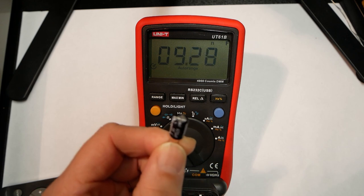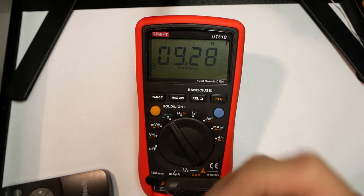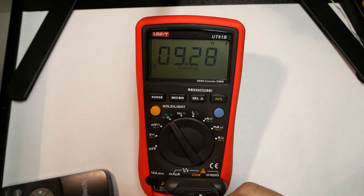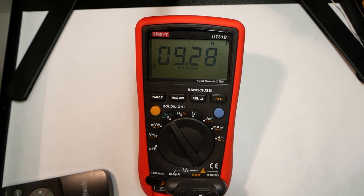And by the way, when you're measuring electrolytic capacitors, if they're big capacitors, like 1,000 microfarads, or they've been in an active system, then before you touch the poles or something, measure it with the voltage measurement to see that the capacitor is actually empty. It's especially important nowadays if you have so-called supercapacitors, they can really hurt you if you're not careful. But this small stuff, low power, low voltage, that's not really a big concern.